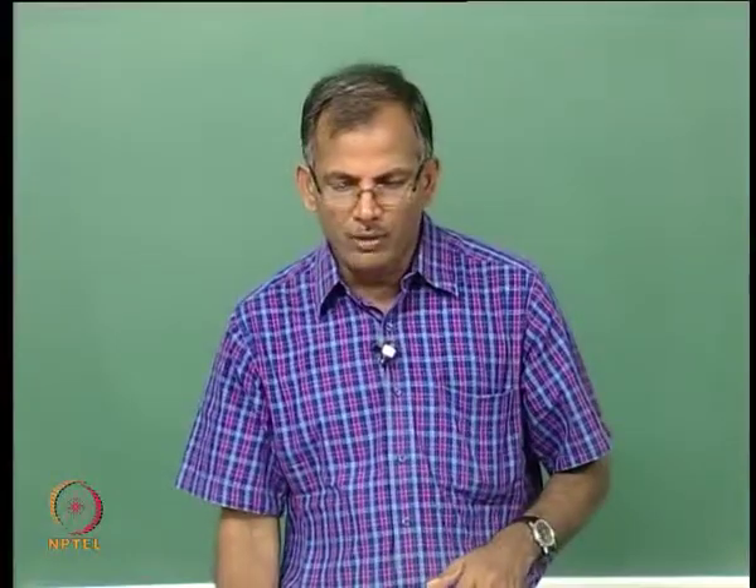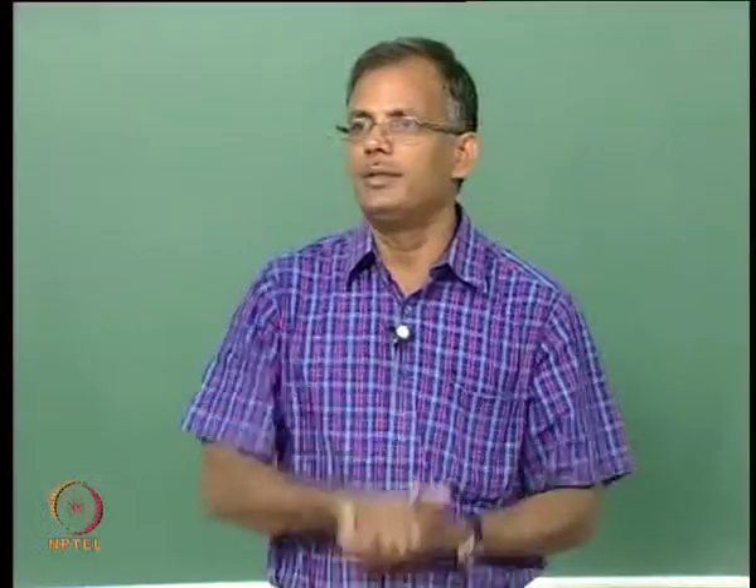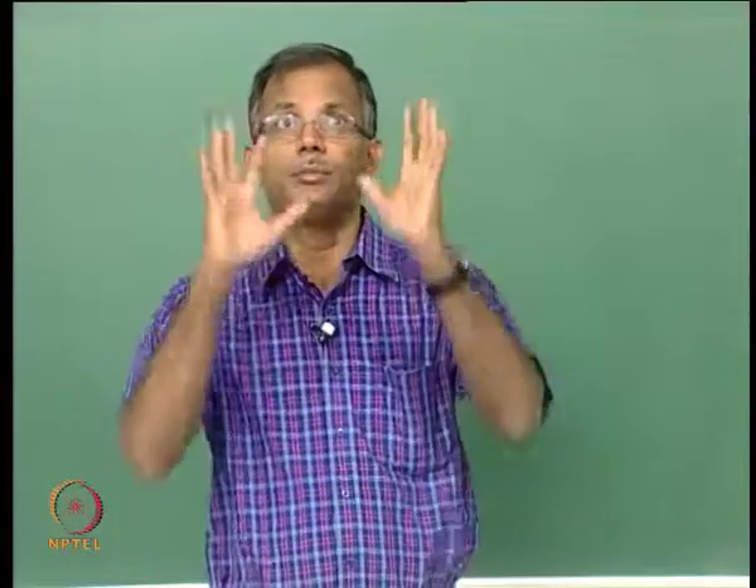Then you can proceed to the calculation of GM and stability parameters, which is purely naval architecture — which we will be learning in the Floating Systems Design course. Most of you may know GM calculation, center of buoyancy, and center of gravity from fluid mechanics. But beyond that, you need to look at static and dynamic stability due to external forces and come up with a positive GM. If the GM is positive, the system will be stable. You need to look at static stability and then disturbed or dynamic stability so that the hull will not capsize and will float upright with minimum disturbances to the installed systems.